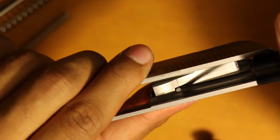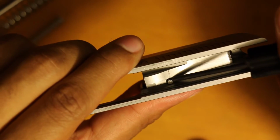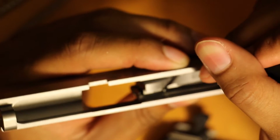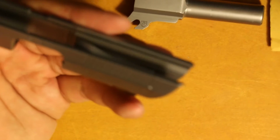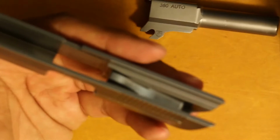And if I want to take this apart, see that button right there? I push that as I push in here. So all of this is kind of tricky. I push this in here, and then that'll pop this pin out, and that'll let the firing pin and firing pin spring shoot out. And then this pulls out, and it all breaks down like you just saw me do.